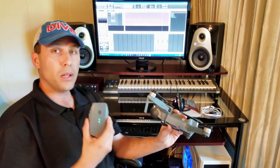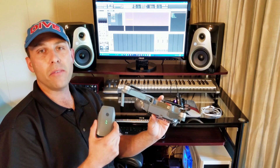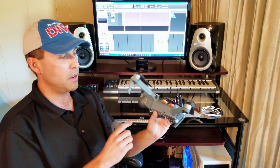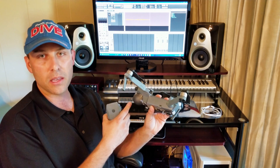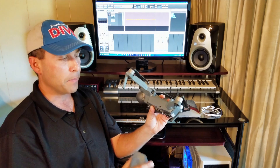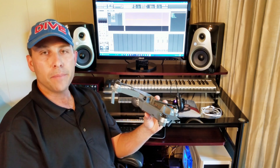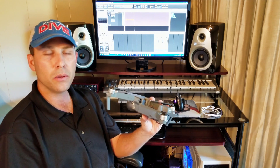Some very important things to keep in mind: when you plug this battery in, it is going to instantly turn on the Mavic Pro. You don't want to plug it in with the gimbal lock still on, because it is going to try to calibrate the gimbal and you don't want any damage. So be careful when you plug that in.